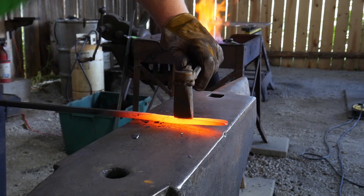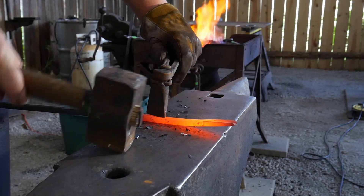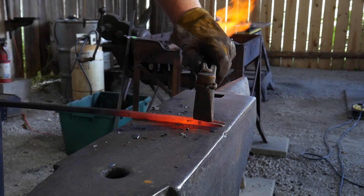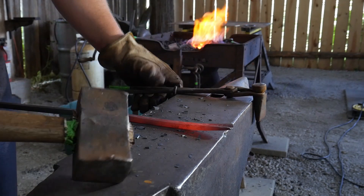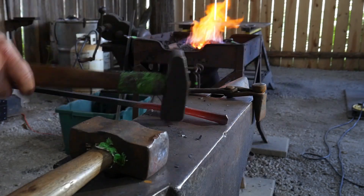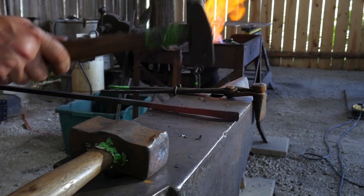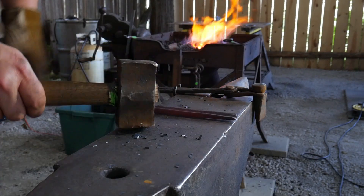There is some scroll work and collar work out there that has a center flute or fuller groove throughout the whole entire piece. That's usually done with mechanical methods and won't be covered here. You wouldn't want to fuller an entire scroll bar — something six to eight feet long — all by hand like this. You would definitely want to set up some dies to do the fullering down the center of the bar for you, perhaps under a power hammer. You could make something at the anvil as well. As you can see, this progresses quite rapidly getting that fuller in — it's really just wash, rinse, and repeat.